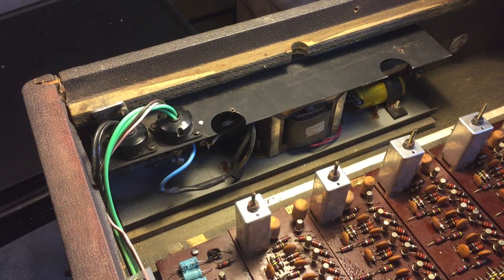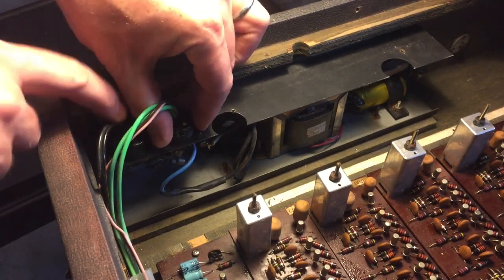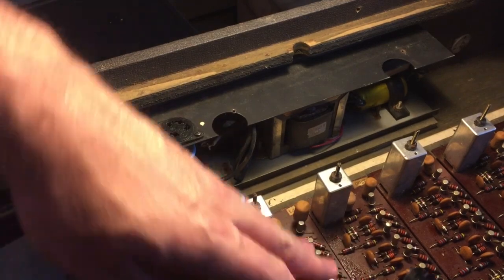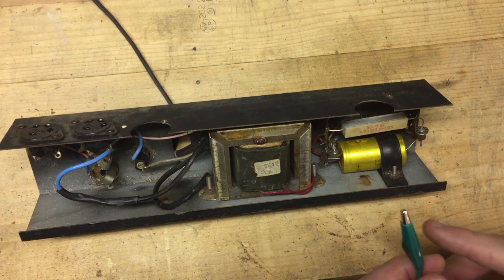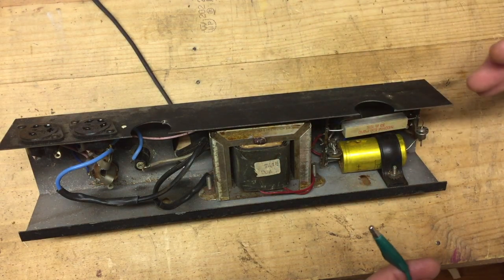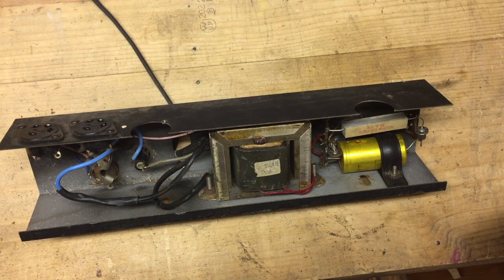For the power supply, I've taken the cover off and removed the mounting bolts. Fortunately the wires that go from the supply to the board are held in plugs, which makes it really easy to unplug them to the side after you remove those bolts. Just lift the whole thing out and take it to the bench. First thing I notice is this big gold capacitor. When I tapped it earlier and the tone changed, that told me it's reacting to a physical impulse, which tells me the problem is not going to be in one of the solid-state things like the diodes or this resistor.